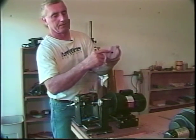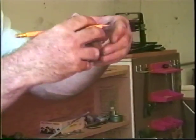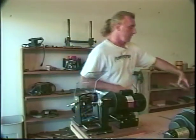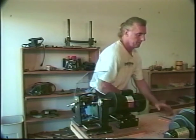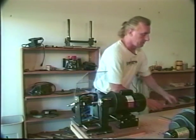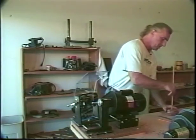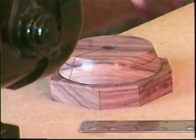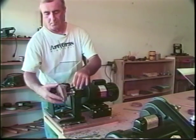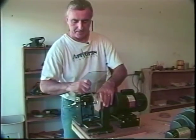Here's your reference line, your double mark. What you want to do now is take it from that double mark and draw a vertical line. You're going to be viewing a vase from the outside, so you'll know those reference lines are important. The next piece we're going to cut is going to be a vertical ring set on this. To do that, it's important to take this piece of stock, mount it on here — in fact get a half inch dowel and trace along the outside of the piece you just cut. Trace a circle, and when you mount it on the ringmaster and put the washer and nut back on, you'll know exactly the outside diameter of the cut you need to make.